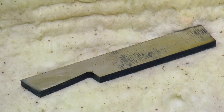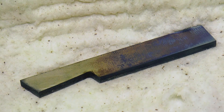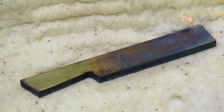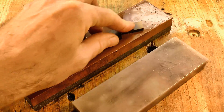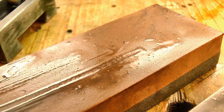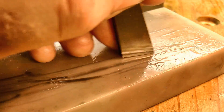I'm aiming for a light straw color. The cutter is now both tough and hard, and just needs some final sharpening. So after a bit more time on the sharpening stones, that cutting edge is now ready for work.